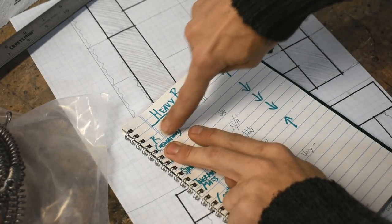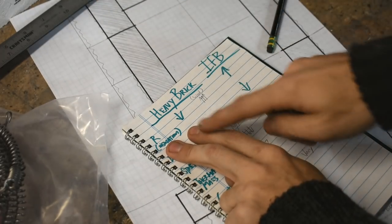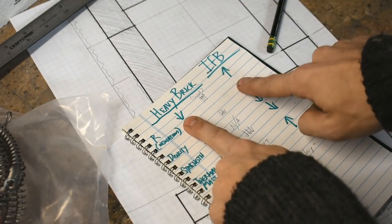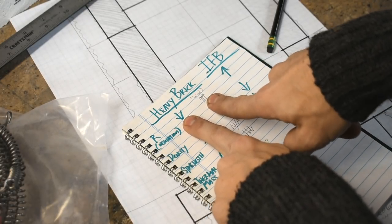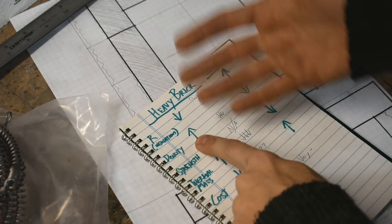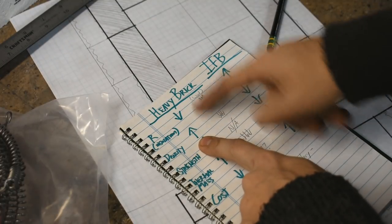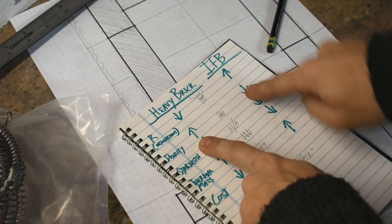So, heavy fire brick, insulating fire brick, R factor, the insulation. You hear things measured in R factor, like windows and insulation? Yeah, it's how much it prevents heat transfer. Higher R number, more insulating. Heavy fire brick does not insulate for crap. Insulating fire brick, obviously, does. Insulates a lot. Ceramic wool, I'm told, insulates way better yet. But clearly, it's not a brick. Density, heavy fire brick, much denser. That's why heavy. Insulating fire brick, very light. That's because it's very porous. There's a lot of air in there. So clearly, air weighs less than brick. Air insulates better than brick. Hence, all of those terms: light brick, insulating fire brick, whatever.